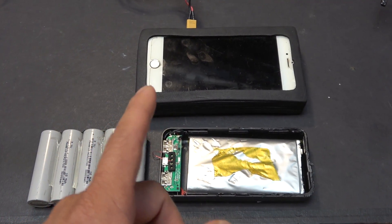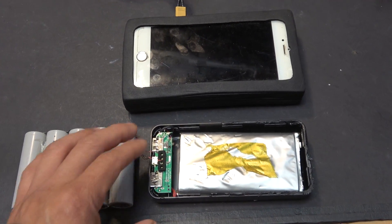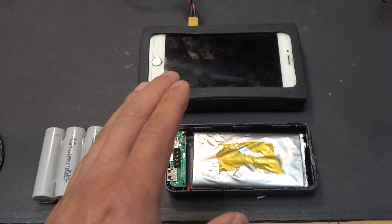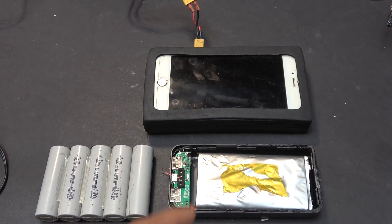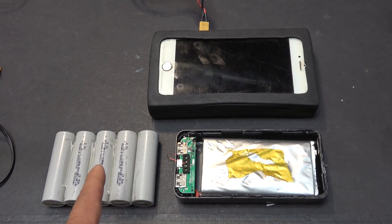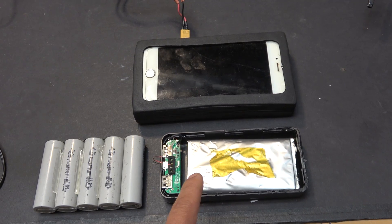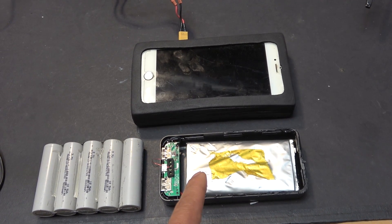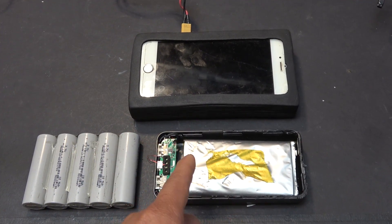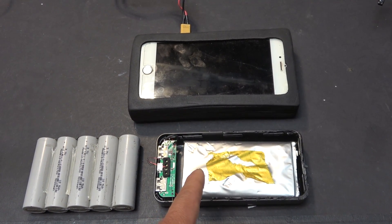Last week I downgraded my phone from a Tesla battery pack down to a pouch battery from a USB power bank. This is 10 amp hour, and after a week of use I'm quite disappointed. This lasts for four weeks on a single charge, so with almost half the capacity I would expect around one or two weeks, but it only lasts for a whopping three days. This is a Chinese knockoff brand and I suspect it is not 10 amp hour as it says on the label.